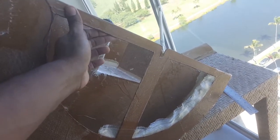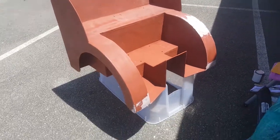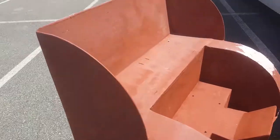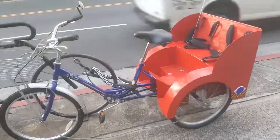Tomorrow I can hopefully do one more sanding, one more layer of resin to even it all out, another sanding, and then it'll be ready for paint. I also decided to cut off those pieces because they'll be troublesome with the fiberglass and will be the weakest point. I still need to make the holes, sand it all down, add some primer, smooth it out with some putty, and do a final paint. Here it is with the primer just finished. There are a few spots that look weak or warped so I added some Bondo. You can still see the resin dripping but I don't have the time or energy to sand it all smooth — I'm going to leave it looking kind of rough. It's pretty solid though.